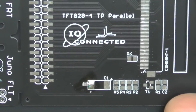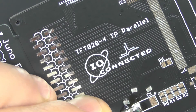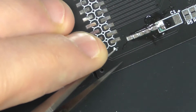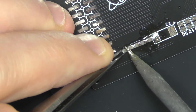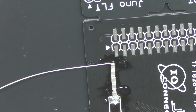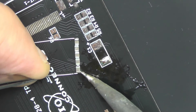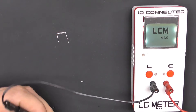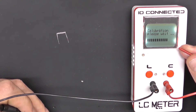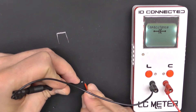I'm going to use a spare PCB I had around to solder these capacitors in series. I'm also going to add some terminals, because it makes measuring a lot easier. One more thing I forgot — it would be nice to measure at least one of these capacitors, because otherwise we're just assuming they're 1 picofarad.